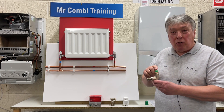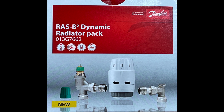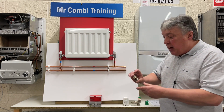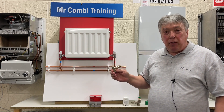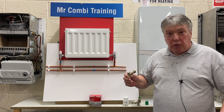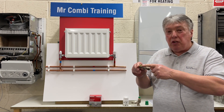So let's have a look at what's in the box. Inside the thermostatic valve box — model number RASB2 — we find not just this valve and the radiator adapter, but also another valve which replaces the existing one. So we have to replace both valves on every radiator in the house, which means we need to drain down, flush the system, and fill it with inhibitor to protect it, because we're starting from new. When we remove the cap, there's a screw valve, and we make sure this is open full.